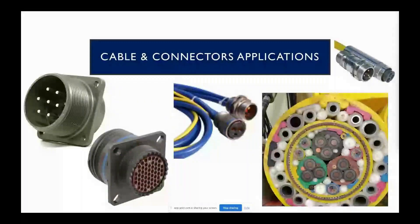Let's talk about some of these cable and connector applications. Here you see a couple of different connectors — these common bulkhead Amphenol style connectors. What we're able to do with our switch is test in excess of a kilovolt up to 15,000 volts. We're able to measure the leakage and isolation of each pin to all other adjacent pins, or it could be all pins, just the shell, or whatever you would like it to be. That's going to be a pre-programmed sequence. Your test fixture would have the mating connectors — you make your connection, run a test sequence, and you are rewarded afterwards with data on every single test point.